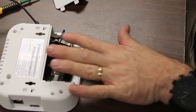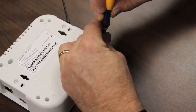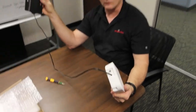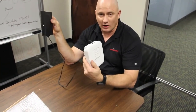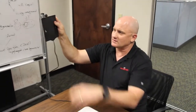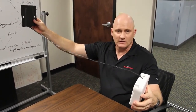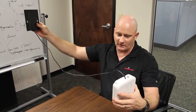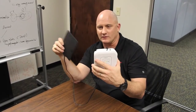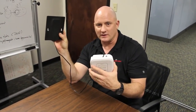The external antennas are installed. Let's put the cover back on — the cover is designed to hide the radio so people won't see it and decide it's something they can use on their laptop. Put the screw back on and now we've got the external antenna. The design point is: take the 6200FX as far as you can using Category 5, then drill a hole in the wall and put the antenna outside, screw it to the wall — it's designed so people walking by won't try to tear it off. This minimizes the coax length, which is where you lose signal. Run the CAT5 with power over Ethernet, then add this external antenna. If this is not the antenna you want to use, please contact us and we will help you with the design.